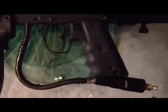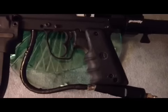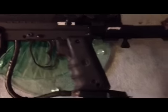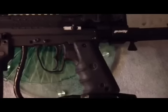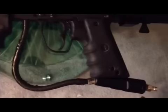The double trigger comes with the Takamo conversion kit. When I originally tried to use the E-grip with this, the firing pin was too long. In my original E-grip kit, I found another firing pin that was a little bit shorter, but I still couldn't get that to work properly. I was getting full-auto fire when I wanted semi-auto, so I gave up and converted the gun back to semi-auto.